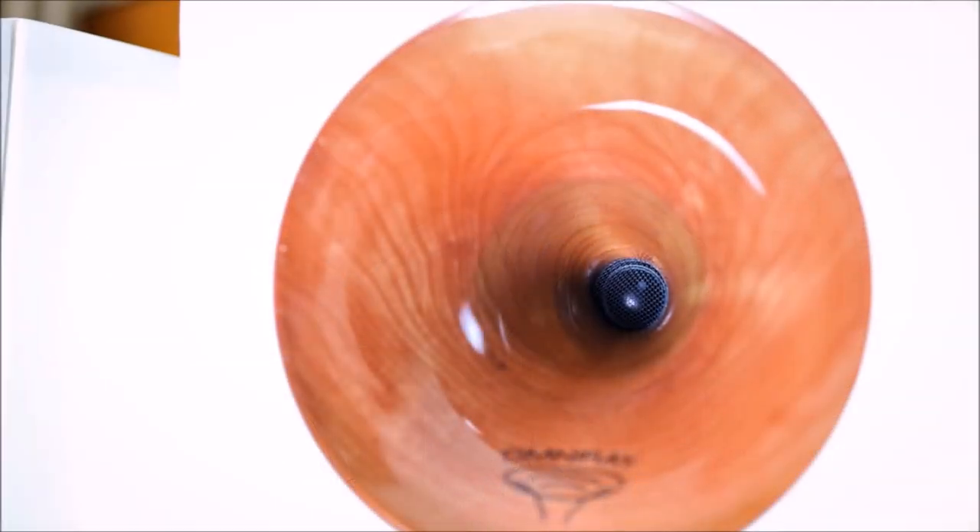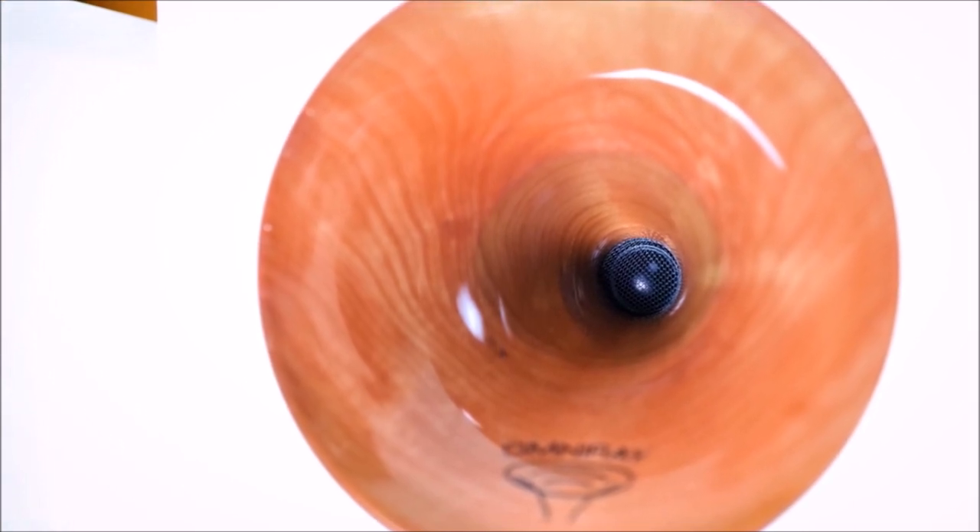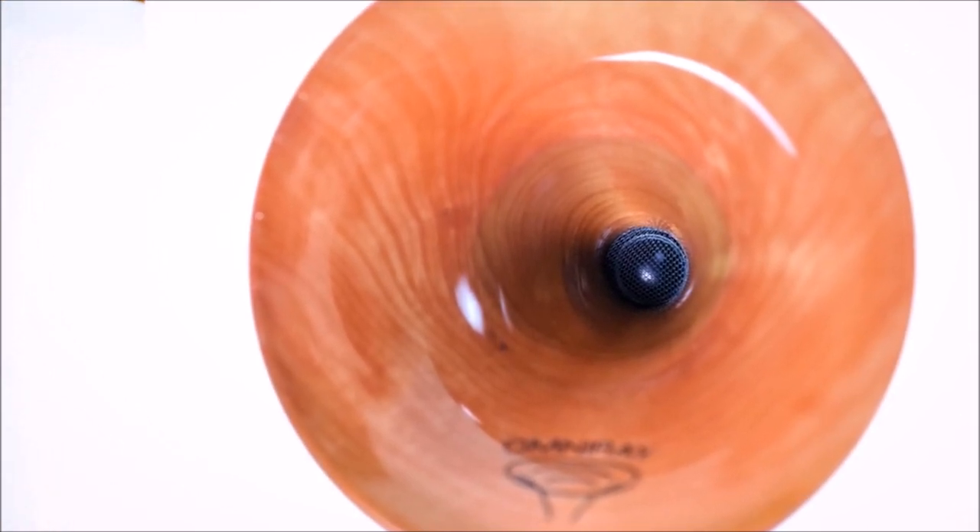This is quite a substantial bookshelf loudspeaker. You'll immediately notice it has a nice horn-loaded tweeter - it's actually a compression drive unit, around a six-inch horn incorporated into the tweeter. It also has a six-and-a-half-inch mid-bass driver. The loudspeaker is a bass reflex design with a port at the bottom.